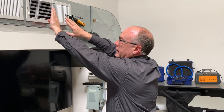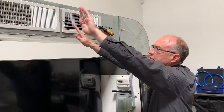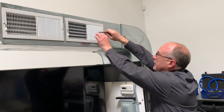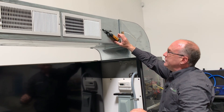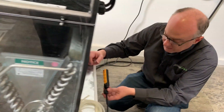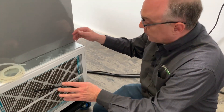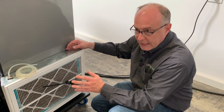If you think about how this air is coming out of this register, it's flowing this direction and it could actually create a circle of air right here just because of entraining air — it's coming out so fast it's pulling in room air behind it. So what will happen a lot of times is if you put it right at the surface of the register, you might get a false reading of warmer air. So you want to make sure you have it in the air stream. In this case I just drilled a hole in the duct, bent the probe in, and now I have it in the air stream. For return air, these are magnetic, so you can just stick them right to the front of the return air grill — this is perfect, you don't have to do anything fancy, you don't have to put it inside the return air grill unless you want to.